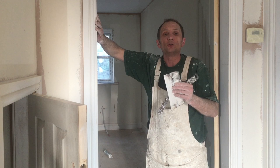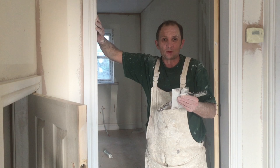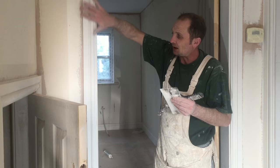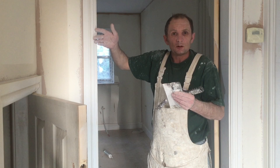Because when I do the cutting in with the spray gun, I'm going to actually hit a lot of the architrave, etc., as I'm cutting in with a wall colour. So it's going to hit the architrave and the emulsion is going to go over the filler and it makes it a little bit harder to rub down. So firstly, when you get in a plot,